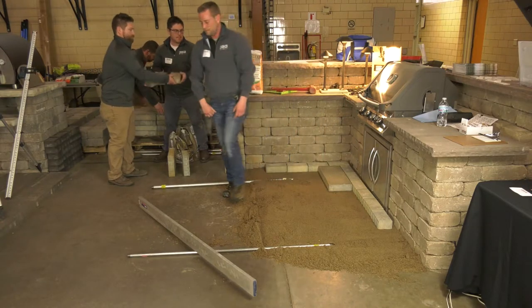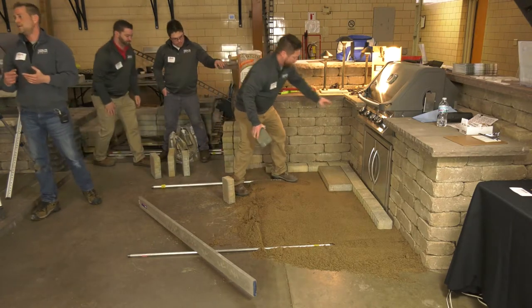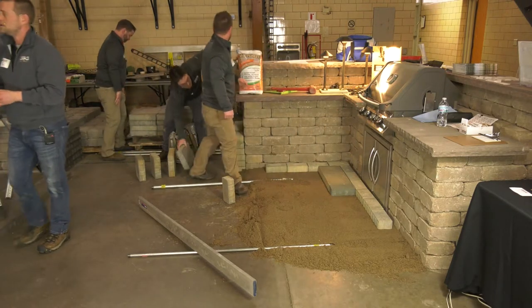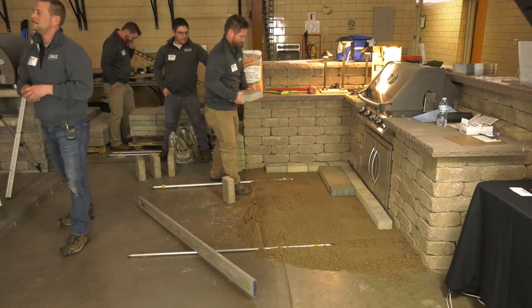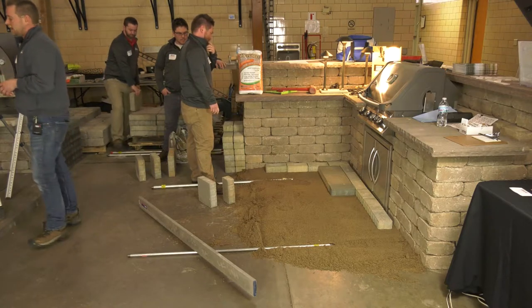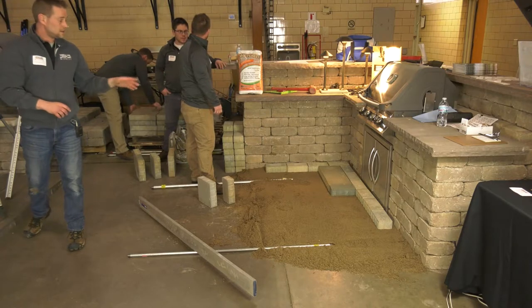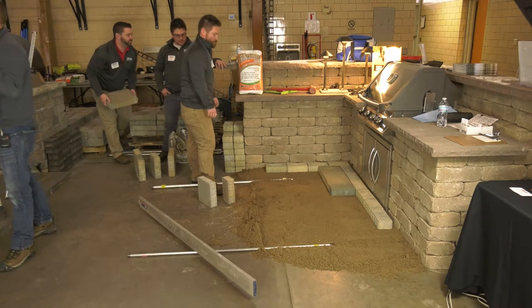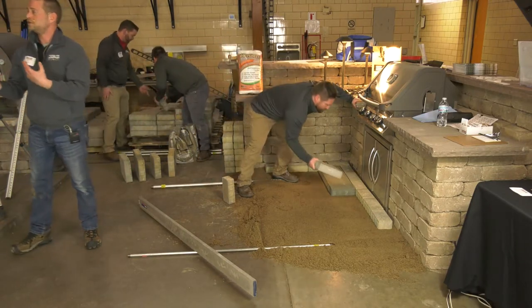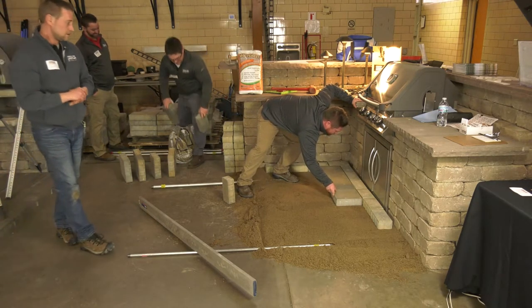So Jim just pointed out that the way that these are palletized, you end up with one big paver to every two smaller pavers. So there's two squares, two small ones, we call them Twinkies, but it's the smallest paver in the pattern. If you're doing a running bond, you have to make sure that you respect the way that this stuff is palletized, because Chris and Joe are only going to take returns by the layer. You can't return by the piece with slate stone. So you want to make sure that as you're pulling off, you're trying to pull off layer by layer. You're also trying to pull off multiple pallets so that you get a good color mix.